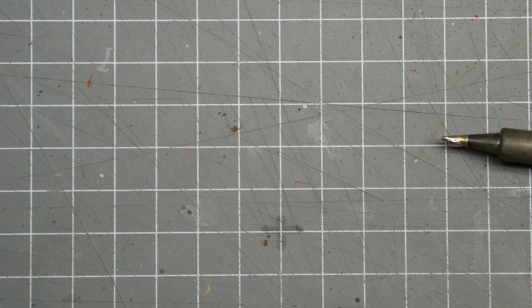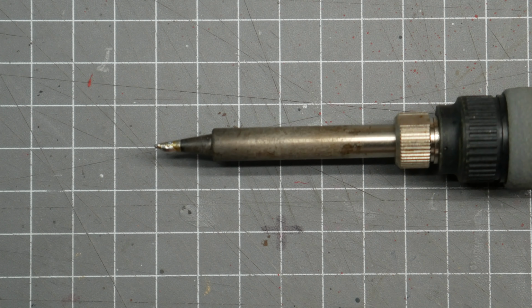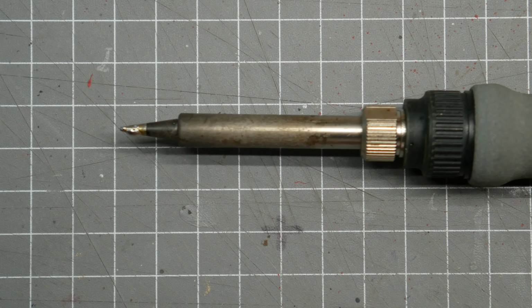Finally, the big daddy soldering iron, the Hakko FX888D. It's actually a soldering station, not just an iron, meaning the brains and power for the temperature control and the iron is in its own unit, not built into the iron itself. The iron connects to the controller, so you have a much smaller, lighter iron. Solder stations are by far the best choice for a bench, providing you have the room. The heat also stays much more stable than the USB or TS100 irons.